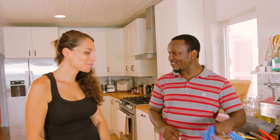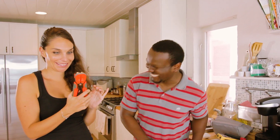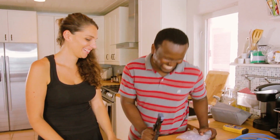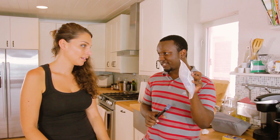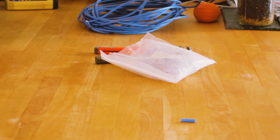Alright, so first of all, you'll need a cable — Cat5, Cat6, whatever, it's the same thing. Then you will need this — this is going to make your life a lot easier. This is a cutter. It cuts and peels the wire for you. Then you're going to need this one also — it puts these on, because you need these. These are the ones that go on the end, the big telephone-looking connector. They're actually called RJ45s. So you need that. And finally, to make sure your wire works, you need a tester.